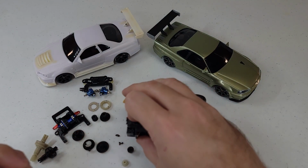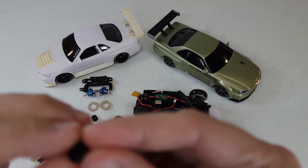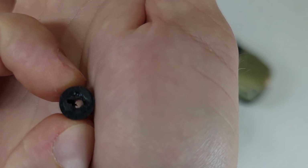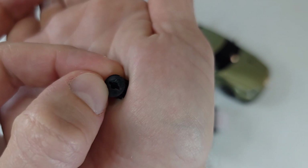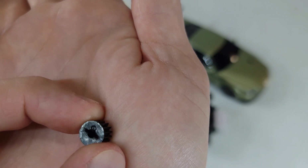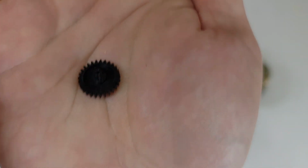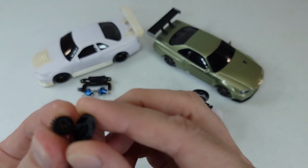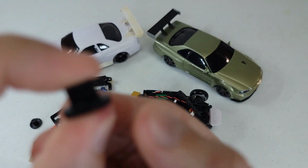Let's see, take that off. And then this one is a 16 tooth. And it's actually, so yeah, I had to cut out a 3mm hole there, and then the 1mm notches on each side to make it the 5mm diameter that it needs to be to slide on to this thing. It's hard to see, so getting the lighting and the focus to work with this black material is kind of a pain, but yeah.